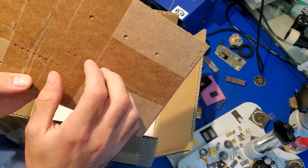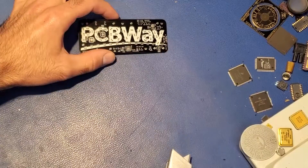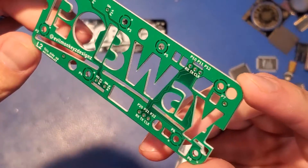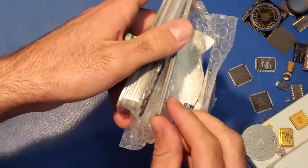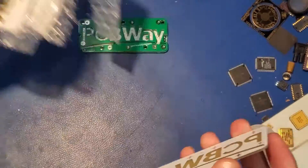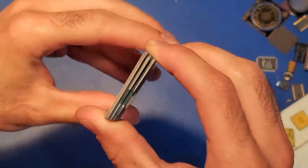In this order I had five different PCBs, and I also got my first stencil — more on that later. The circuit stack illuminator prototype consists of a total of four different PCBs which I call layers. Layer 1 (L1) is the base PCB that has all the components soldered to it. L2 attaches to L1 with pad-to-vias and has cutouts for all the parts on layer 1 so they can fit snugly together. L3 attaches to L4 also with pads-to-via and only has a cutout for the PCBWay logo. L4 is the top layer — it has a cutout in the solder mask and copper layer in the shape of the PCBWay logo in order to let the light from the LEDs shine through. Here is an example of what they will look like when they are all stacked together.